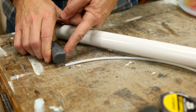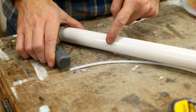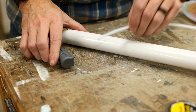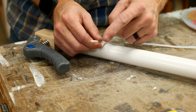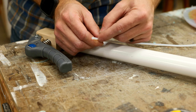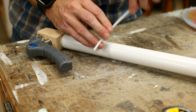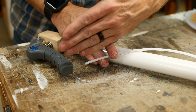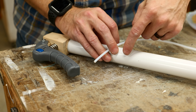We're going to need the cable to come off the handle and go up into this metal pipe, but we don't want it scraping on that opening. So we've got some PTFE tubing — this is what your filament goes through on a 3D printer. It's really slick plastic, and we're going to try to drill the hole and mount this inside of it so that the wire moves on the inside of the plastic rather than on the inside of the metal.